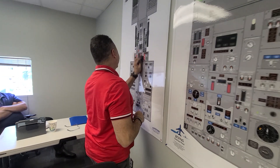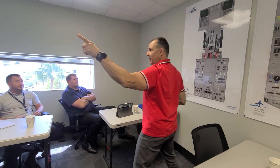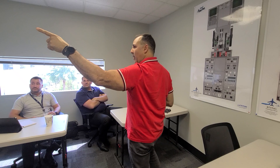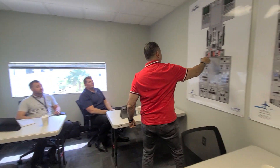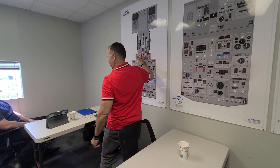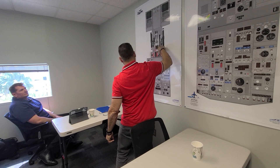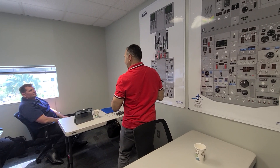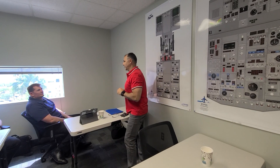So if you don't have AC power, then it will be ten lights. Five in the front — same thing, left to right: fire warning, master caution, overheat, master caution, overheat — that's five. And then you come to the back: overheat six, number seven, eight, nine, ten. That's if you don't have AC power, because remember the wheel well is powered by AC transfer bus number one.